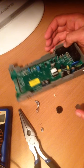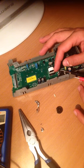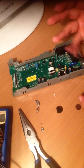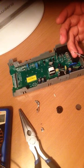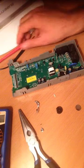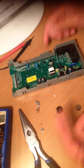My fuse has continuity, so when you install this control board back into the dishwasher, it will work perfectly. The fuse may blow again after three, five, or six months — there's no way to know exactly. The fuse blows due to power surges in your house, or if you have an older dishwasher with rusty, worn components that aren't functioning properly.